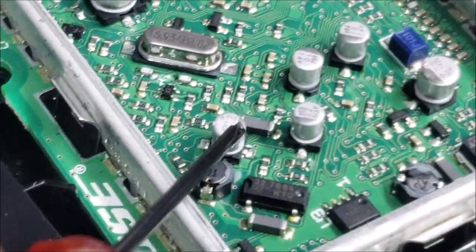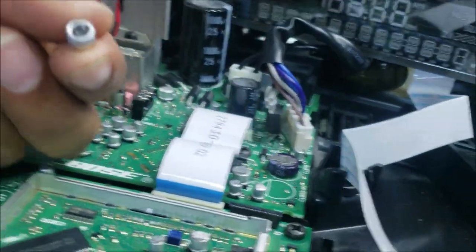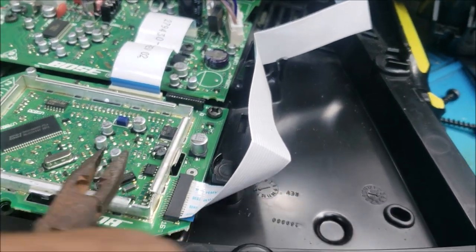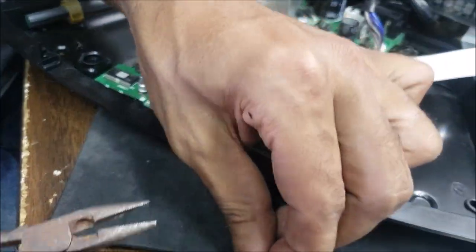And you can see the black paint, that's the black mark, that's where the negative side is. The safest way is to desolder one side at a time, but you can do it this way too. Just hold the capacitor down, then twist it. Don't pull it, twist it. Here, the capacitor is out. Let's do another one. Don't pull it up, because you're gonna damage the traces. Hold it and twist it. So we have 100, 22, 22, 10, 47. Do you remember? Okay.